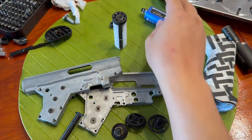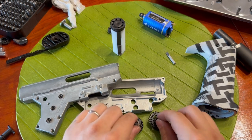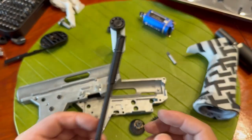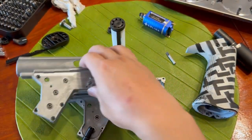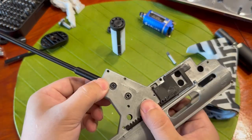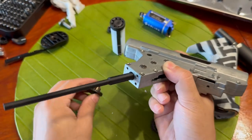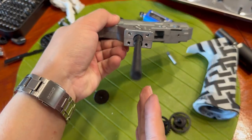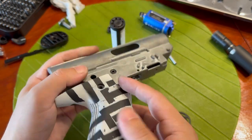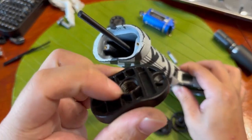To shim these gears, there are so many videos about shimming, so I will just go through the most important parts. First, you get one of these — it's an alignment checking tool for your gearbox. I 3D printed this one. Basically, the two studs go into the hole where your bevel gear is, and this will be perpendicular to your gear. Then you put on your grip, your motor plate, and this pole should be in the center of this hole.